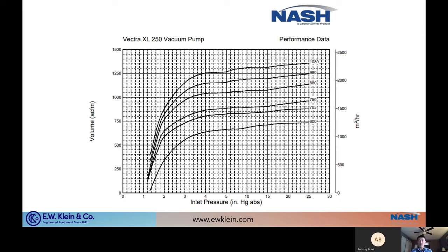This is a typical pump curve — an XL250 Nash pump. If you plug your VFD in and turn the pump at 1,080 RPM, and the operation is running at 20 inches mercury gauge, the curve tells us you'll get a capacity of about 1,300 ACFM. If you drop the RPM to 750 RPM for the same operation at 20 inches mercury gauge, now you're pulling at 900 ACFM. The advantage is that for operations with different capacity needs, you can save energy because slower RPM means less horsepower consumption.